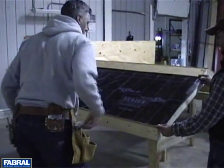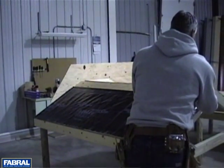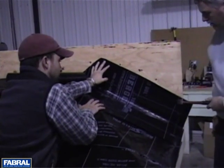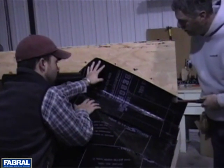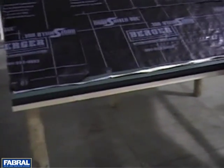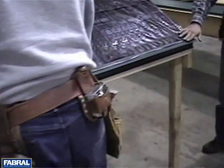Areas that have been torn or cut should be replaced or repaired prior to installation of the Climaguard panel. At sidewall and end wall conditions, continue the underlayment a minimum of 6 inches up the wall and fasten. To prepare for installation of the first panel, apply a bead of butyl sealant along the eave trim.